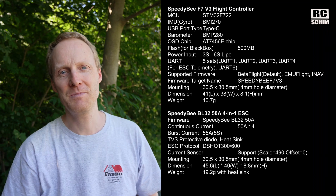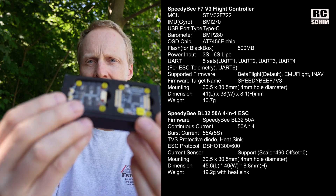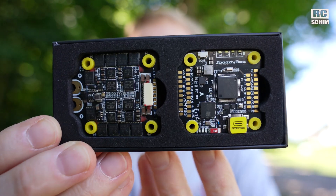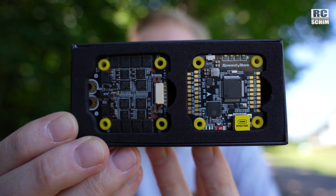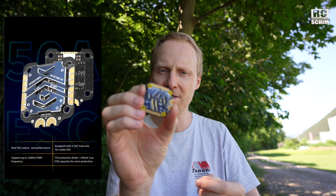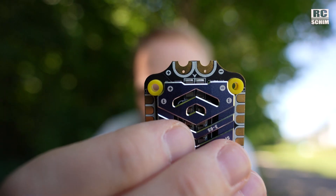If you just want to know all the specs, I'm sure you can find the web page yourself — nonetheless I will show the specs here in a little box. Meanwhile, here's a close-up of the ESC and the light controller. It's pretty beefy; the ESC board alone has a heatsink, it's nice, the solder pads are large enough even for me. The main power lead connector is pretty nice — a true 50-amp ESC, so it should be enough for larger or more power-hungry copters.